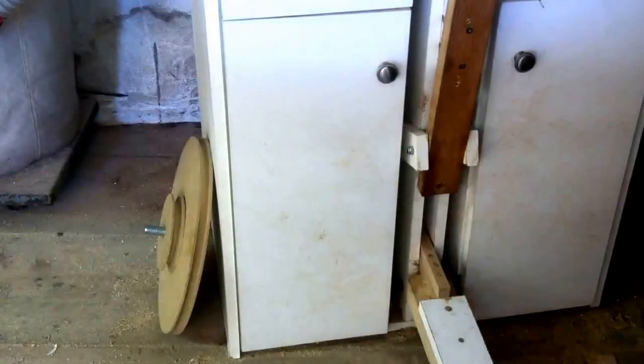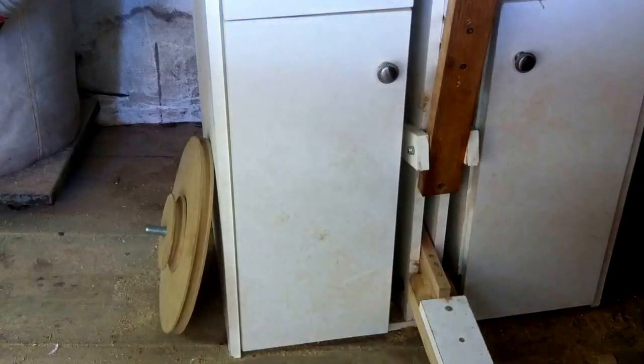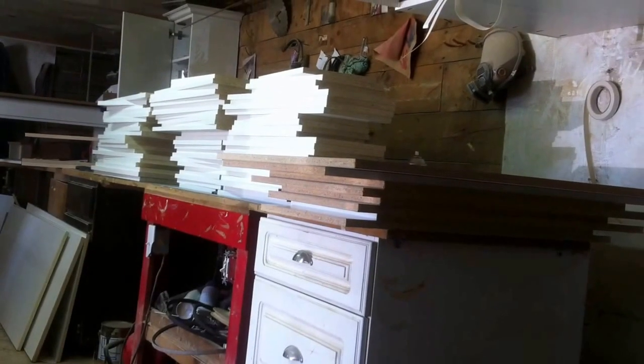I'm doing at least a kitchen a month, and a lot of the time at least two. If you haven't seen the way I build my cabinets, I'll show you one I've got stuck up on my shop wall here. It shows the bottom of it, and you can see the string of pocket holes. The back is put in the same way, and the top cabinet has literally 50 screws, probably, if I added them up. I've got quite a chunk of a kitchen here, a big pile of panels, and that's what I was drilling out.